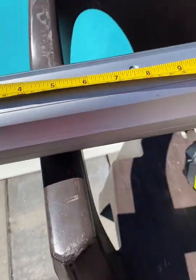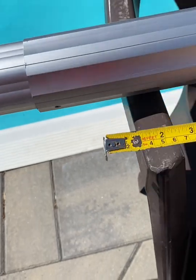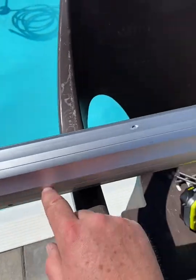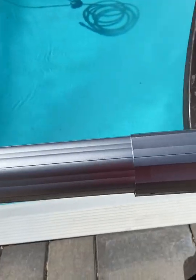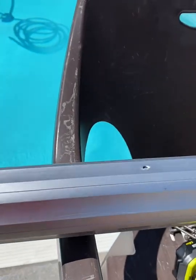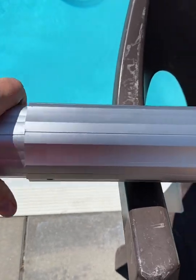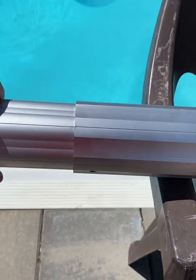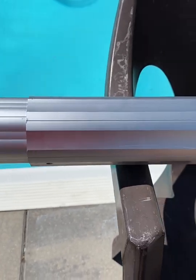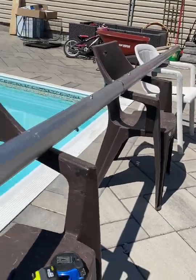The other hole is bang on seven and a half inches up. The holes on the outer beam are pre-drilled — what you're drilling through is the inner beam. You want to turn it upon itself so it's snug; you don't want a lot of play. Lock it in and then drill your hole so it's locked in good. You're going to be drilling eight holes total — all eight bolts and screws are in, making for a pretty solid piece.